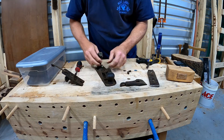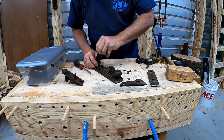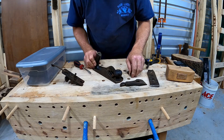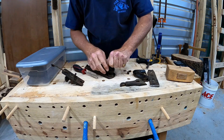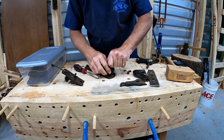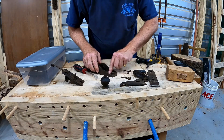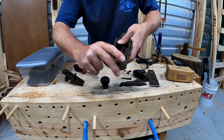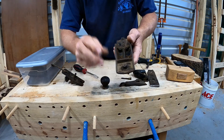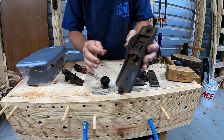Let's look at the underneath of the frog. Here's the frog - it doesn't look like it's damaged, broken, or cracked. You can still see the original marks on it from where it was made. You can see the old slime and dirt in there. The adjustment screw moves, which is good, so I can adjust the frog back and forth. The rear handle screw isn't seized up and doesn't seem to be bent either. A lot of these screws are bent. It is bent - you can see when it was dropped this thing got bent. We'll straighten that back out.